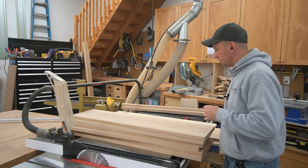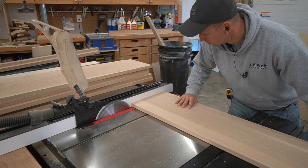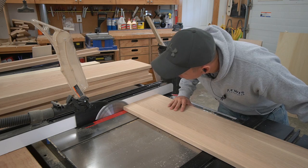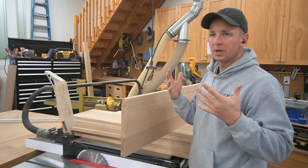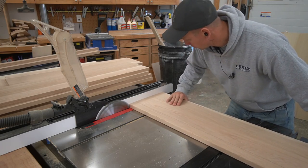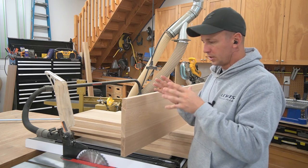I'm just about ready to start assembling this closed staircase section, but before I can start putting things together, I still need to do the cope cut on the ends of my treads for the nosing to pass through. Remember, a cope joint is just a pass-through joint. Usually when coping, people think of crown molding or baseboard, but all we're doing in those situations is creating a pass-through joint, and in this case we're going to do that exact same thing with the stair nosing.